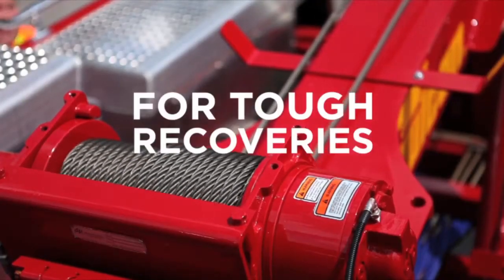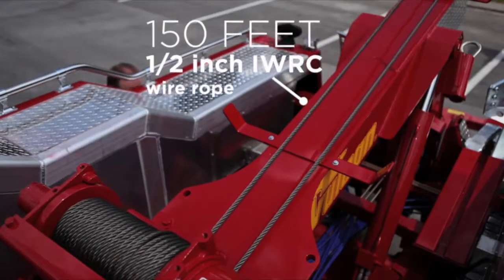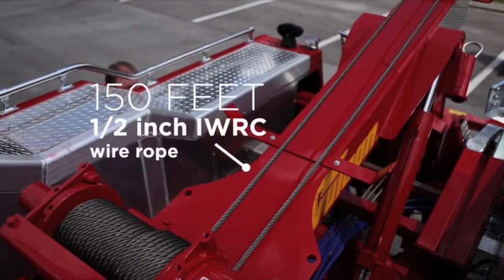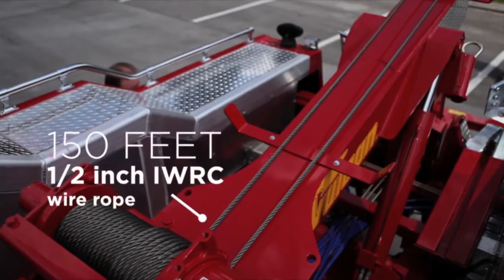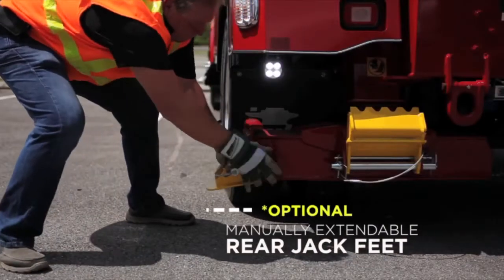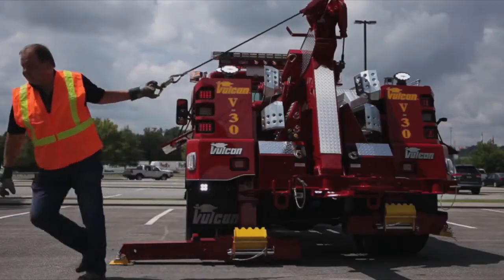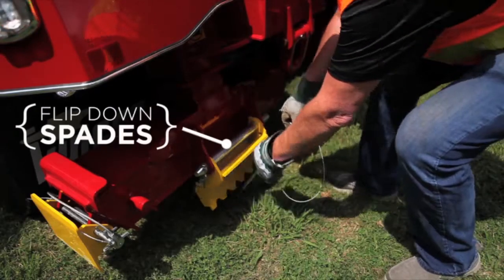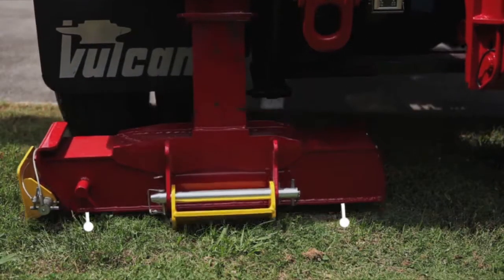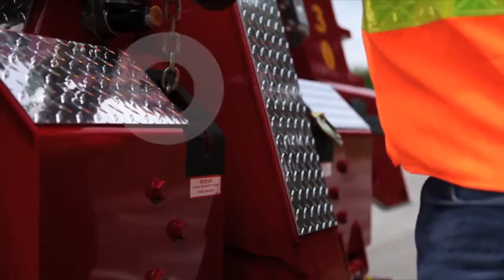For those tough recoveries, the V-30 is equipped with dual 15,000-pound planetary gear winches, each with 150 feet of half-inch IWRC wire rope. Air clutch releases and cable tensioners are standard. Manually extendable rear jack feet are available to provide increased stability during side pulls, and feature flip-down spades for better grip on soft surfaces. The rear tailboard features heavy-duty cast D-rings, built-in pockets with safety chains and air and electrical